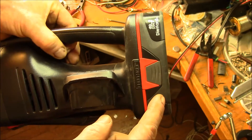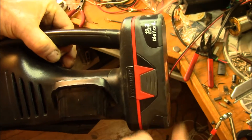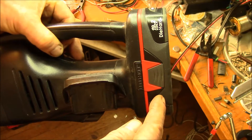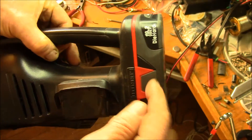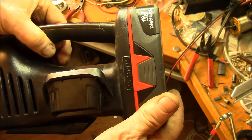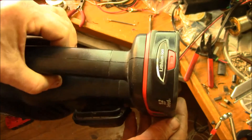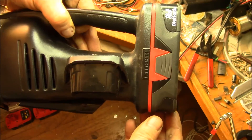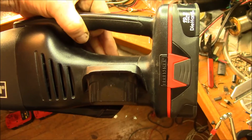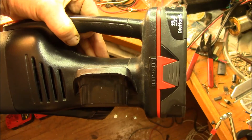I hope you enjoyed this repair video. This pack had two bad cells — I showed you how to troubleshoot it to determine the cells were bad, how to take the cells out, and how to put the new ones in. I paid about twelve to thirteen dollars for the pack with shipping, and around fourteen dollars for the two cells, so about twenty-seven dollars total for a working lithium battery pack — about half the price of a new one. If you liked the video, give it a thumbs up, check out my other videos, and subscribe to the channel. I'll update you when I get a recharge on this to see what capacity we have.